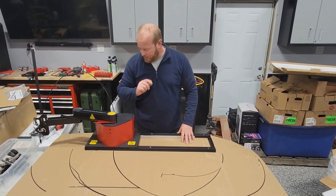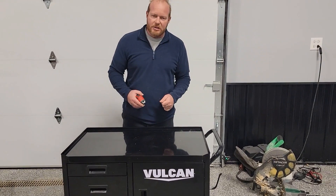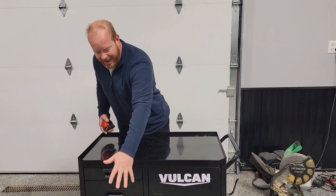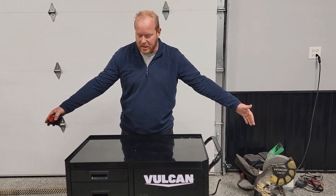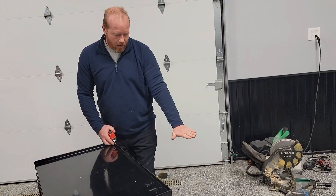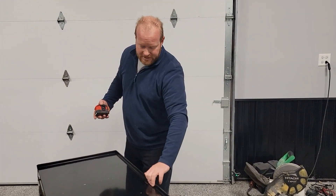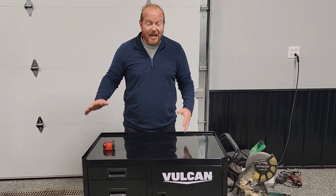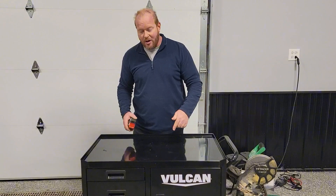Because I don't like anything being stationary, let me show you the cart I chose to put my table on for the plasma cutter. I'm going to build a water table, so it'll be about five inches deep. This is a nice strong cart I got from Harbor Freight — it's a welding cart, similar to the one I have for my welding rig. It gives me storage underneath. The cart is three by a little less than two feet, so we'll have about a foot and a half overhang on each end. The plasma cutter will hang off one side with brackets, and the X2 will be on the other edge — one semi-compact table I can move around the shop. The great part about being on wheels is I can push it over the drain to drain the water, or move it into the corner when not in use.